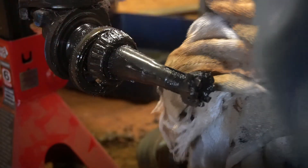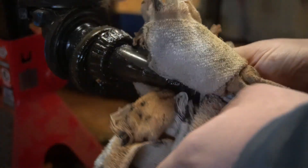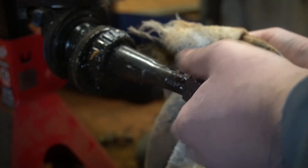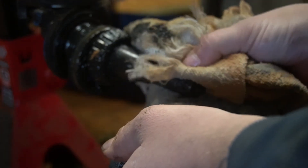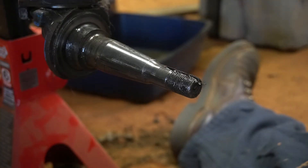Probably the hardest part of this whole job is jacking the tractor up. Second hardest part is dealing with all the grease, because there is a bunch — especially when you have one like this that somebody has just pumped full and full and full of grease. There's no need for that. Look at all the grease in there — that's way too much. That's all there is to getting the bearings off. Whenever the time comes to put it back together, I'll have a video of packing the bearings and reassembling it.